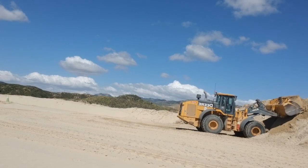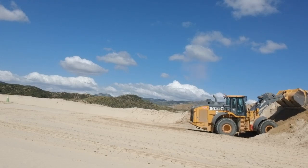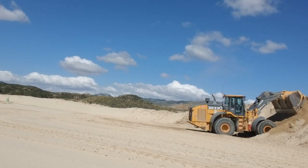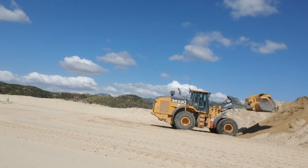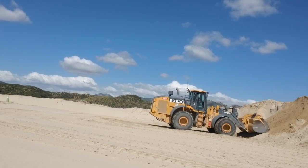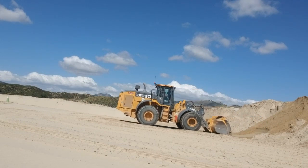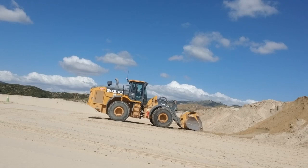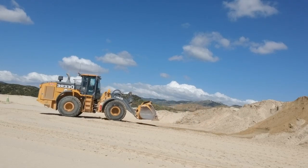This is a buck up. I'm driving into the pile with a full bucket. This material is kind of soft, but you can really climb up that thing and push that material up. I dug a little hole for myself, so I'm going to take some of that material, back drag it, and fill in that hole. It'll make life really hard if you keep having to drive into that hole every time — that's how you fix it.